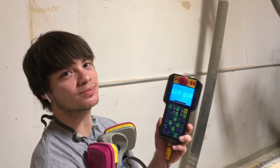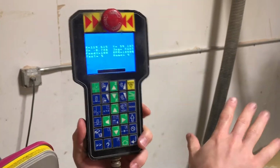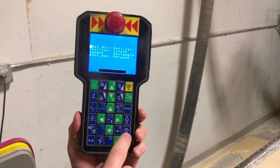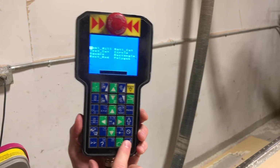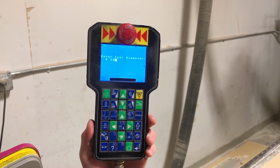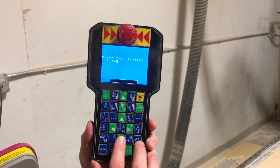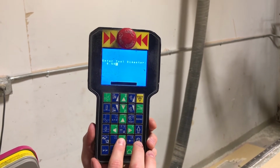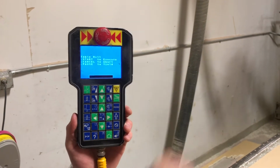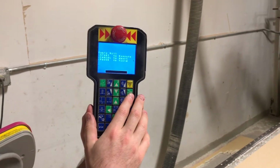All right, so the last step of the video that you want to do is press menu. After you have everything set up down there, you want to press menu, cut utilities, enter, table mill, enter. Now we know it's tool 5. Now we know the diameter is definitely a lot bigger than 1/2 inch. This bit is about 2 inches, but we're gonna do 2.3, enter. So when it overlaps, it will take off that little extra left on the table. There won't be any little bits of residue. So it is ready to go.